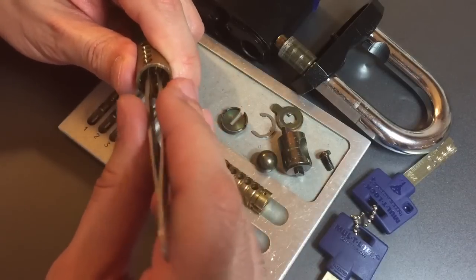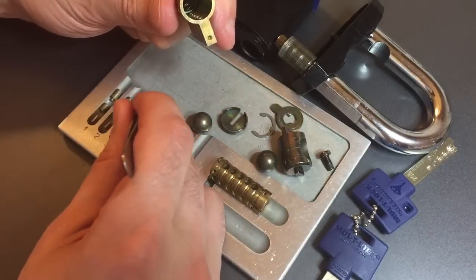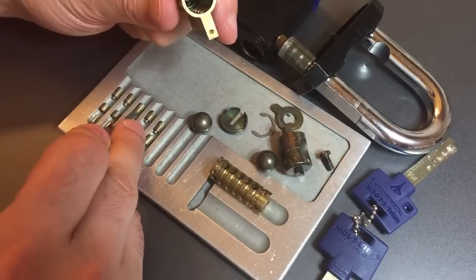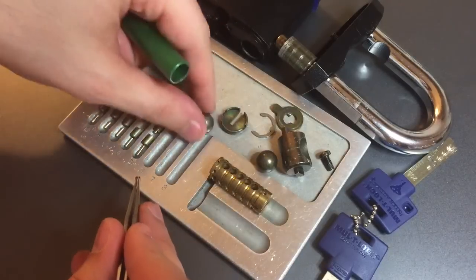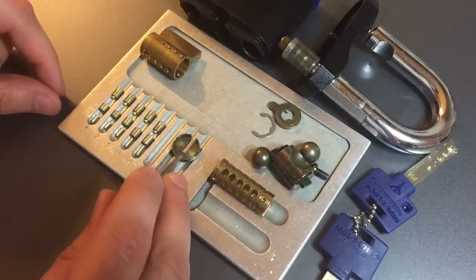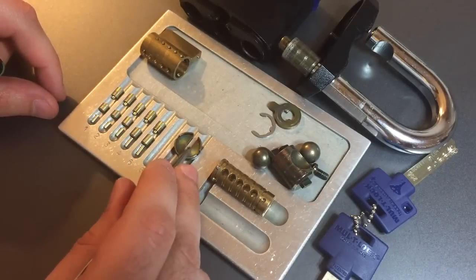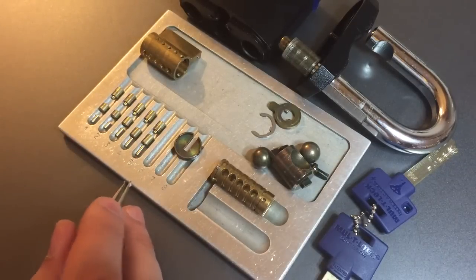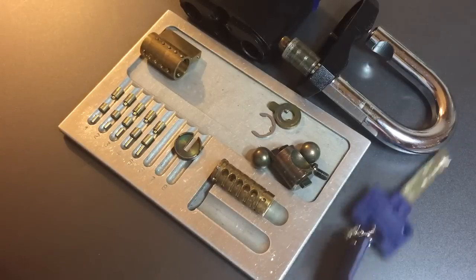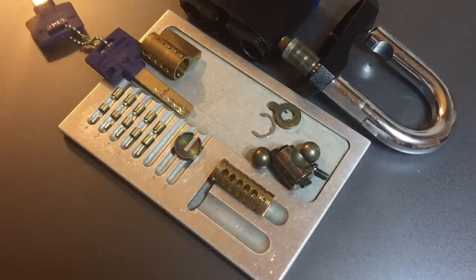As I said, I also didn't feel any spooling on the inner driver pins, and that appears to be correct — I don't see it on any of these. Over in slots seven and eight I'm dropping a piece of drill protection they put in front of the core — it's always a nice feature to see. Let's move in for the close-up.